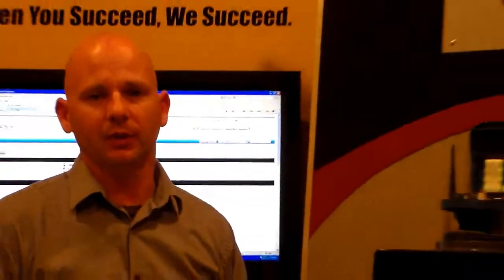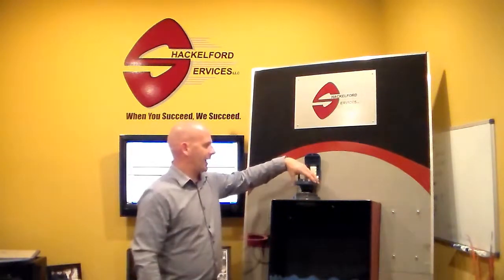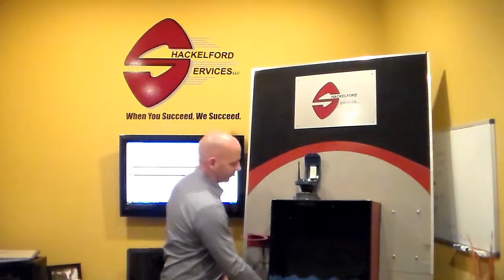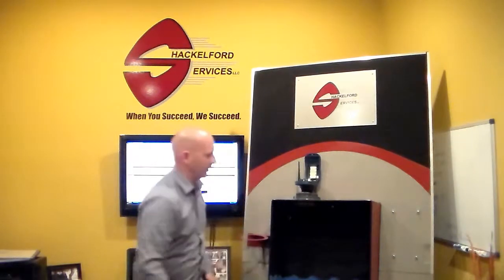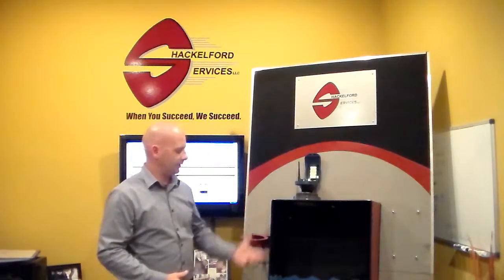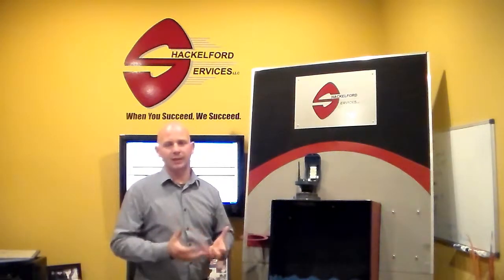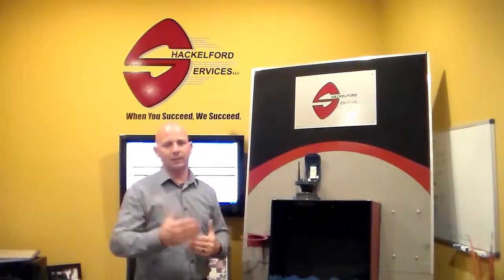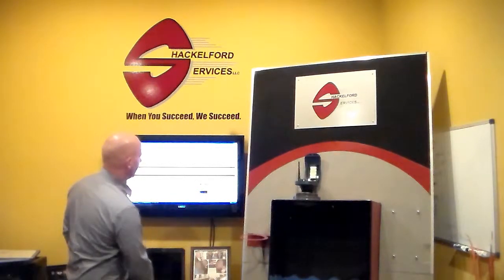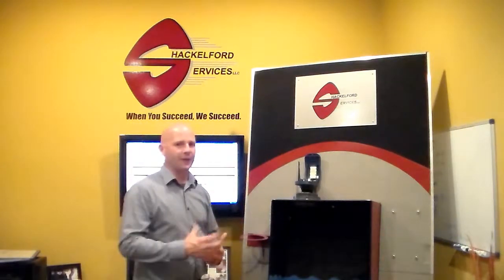The purpose of the video today is we're going to simulate a low level. We're going to show how fast the unit updates the website as well as generates that email. This unit is an active unit — we've got it set up to wake up every 30 minutes. To keep the video short, we're going to force updates by pressing the start button. We're moving our target down to a low level situation and then forcing the update. Forcing the update wakes the unit up, it takes the reading, communicates to the server. You can also do a manual entry on the unit if there are any changes to parameters — so it wakes up and grabs those new parameters. Once that unit gets the level reading, it'll transmit and update the website. We're going to refresh the screen as soon as this unit completes its communications, and you'll see just how fast it updates the website.